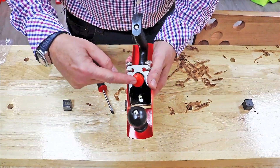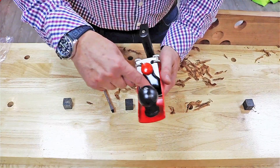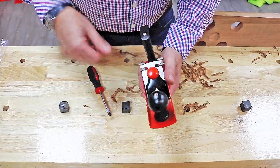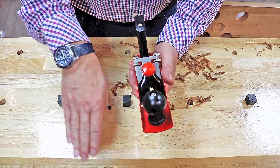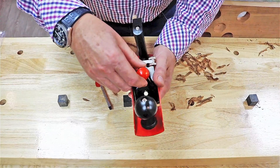On the top here is a red knob. If you unscrew that, this black cap iron lifts off — there's a little slot here it can come off. There are then two adjusters here, either side, and what they do is control the movement of the blade left and right. Slacken this off a little bit, just enough so you can move the blade and adjust these two.